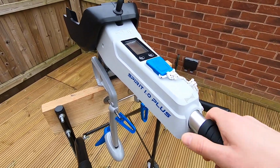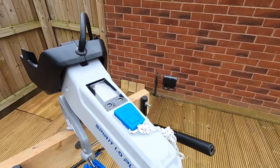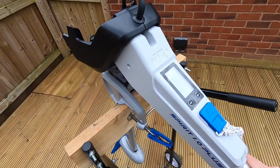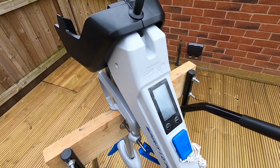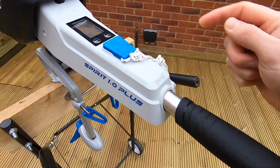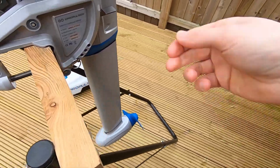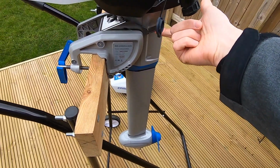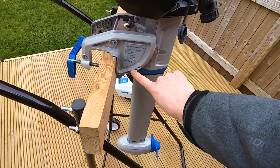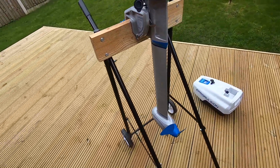The tiller is already attached, so I didn't have to attach that at all. You do a kind of pull method, which I don't know if I can show with the GoPro, but you pull that first and then the tiller can drop down out of the way. You see it clip back in. They've got the kill cord attached, and that's basically all you need to do. This side here you've got your release for when you're going into shallow water, and you've got a number of trim options to get the leg nice and straight when it's on the back of whatever boat it's on.